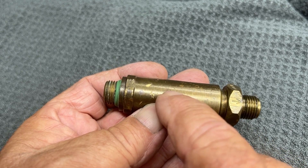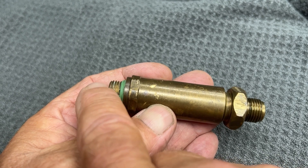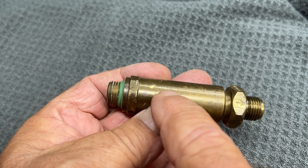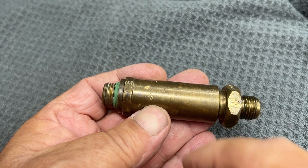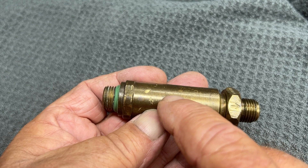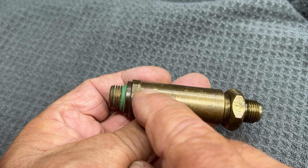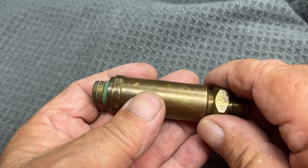The purpose of the high-speed bypass is that when you hit that high pressure, the little ball in there with the spring — you set it for the pressure you want to start relieving at. This is your high-pressure side, connected to the same line that goes up to your barrel valve and your nozzles. Depending on your motor, it could be 80 PSI, 90, 100 PSI or even more. When you hit that pressure — whatever you have the spring set at — there's enough pressure to push against and overcompensate that spring, open the ball, let fuel through, and then through the little pill that's in here.